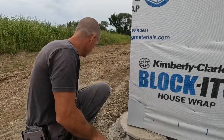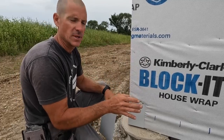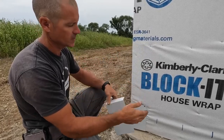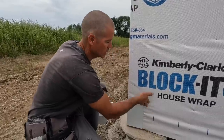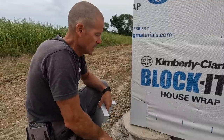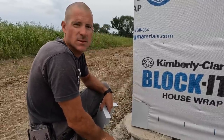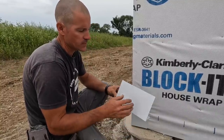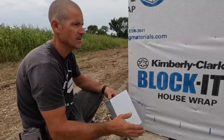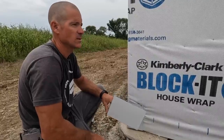I make these little corners. Whatever color the client is using for their sidewall, I get what's called a post trim - basically an L shape - and this is 10 inches. I run that down underneath my grade board and up, so when we put our first bottom trim on, the whole bottom is trimmed out the same color. It looks really nice and also protects your bottom grade board. This stuff is painted steel - pretty stiff - so I just make corners because they're a lot easier to build and get a nice crisp bend on. Then I take the next piece, overlap it, and run it down the side. I'll throw all these on quick and then the guys can go along and put them on.